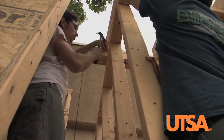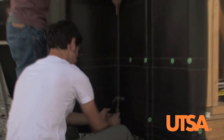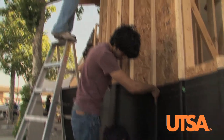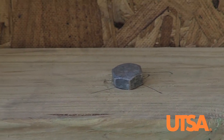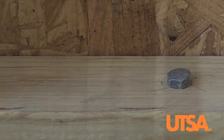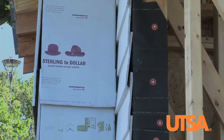We had some troubles with the material at first because we didn't really know how to apply it to the wall without breaking the seal. We wanted to keep it sealed. We tried using rubber cement, concrete cement, contact cement. It would hold, but eventually the hold would break. So we ended up having to make some bolts on the back of these panels that we had. The panels are basically going to be the module that we use to be the cladding for that system.